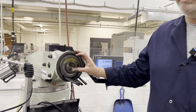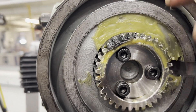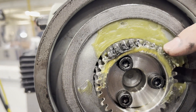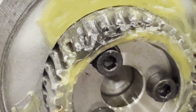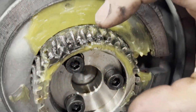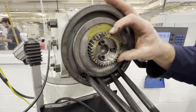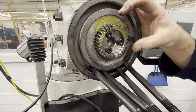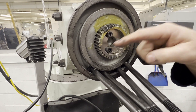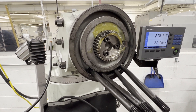While I have the head off the machine, this gives me access to this pinion gear. It's a 360-degree gear and it only rides on the top few teeth, so I'm going to inspect that for damage. I can see there's a damaged tooth here, and also these bolts have come loose. I'm going to take this time to rotate the gear so I can get a fresh set of teeth up on top, clean it out, and put these bolts in with Loctite. So I've done some preventive maintenance while I have the machine apart.